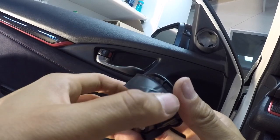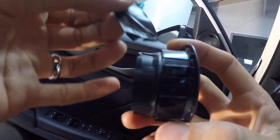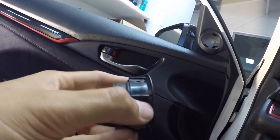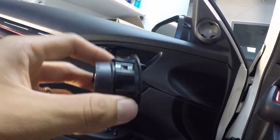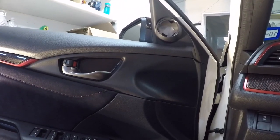You don't have to do it the exact way I did it — this is just what worked for me. After this video was shot, I cut another section of electrical tape for the one missing section. Assembly is pretty much the opposite of disassembly: just pop the connector back on, make sure it's aligned when you insert it into the hole, and your tweeter should be buzz-free after that. If you found this video helpful, please be sure to like, subscribe, or comment below. Thank you.